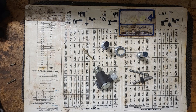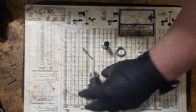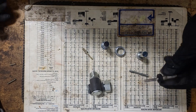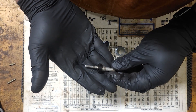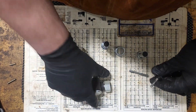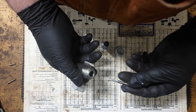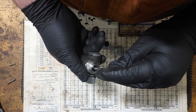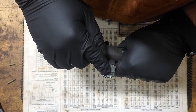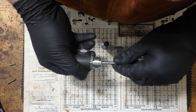So to start out, we're going to make sure we have everything we need. We've got our ferrules, our tips, everything like that. This customer is looking for a right angle adapter, so we're going to fit that on as well. Now, what we're going to do is something a little different. The bottom end of the cable he currently has has this 150 square tip on it. We're not going to do that because it's going to be going into an adapter, and these adapters default with a 187 tip. So what we're going to do is fit the cable with the 187 tip on this side and give a 150 square tip on the end of the adapter so it can screw into his transmission and the cable will all run smooth.